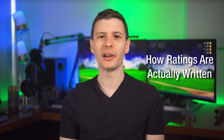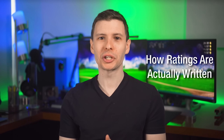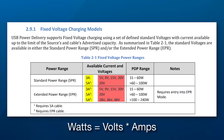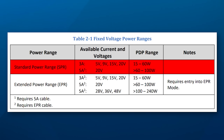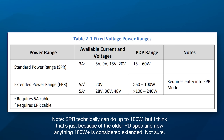I've been mostly talking in terms of wattage, but in the USB specifications the ratings are actually defined in voltages and current. Wattage is simply those two multiplied together. Within USB Power Delivery there are actually two tiers: standard power range, basically up to 60 watts, and extended power range, which includes up to 240 watts. Interestingly, the current ratings go from 3 amps to 5 amps for the jump from 60 watts to 100 watts, but don't go any higher — for everything up to 240 watts, that extra wattage comes from increased voltage.